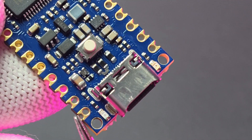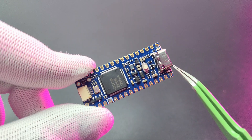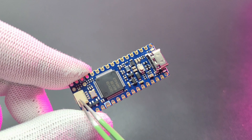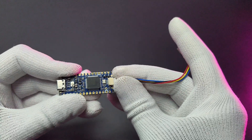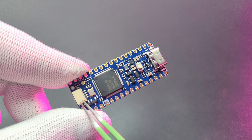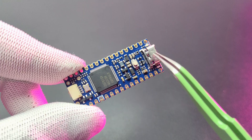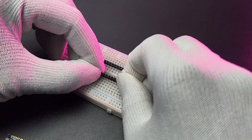It has both THT pin holes and SMD solder holes. The board has a USB Type-C port for programming, and it has a QWIIC connector where we can connect 3.3V I2C sensors and Arduino modules. It also has a 5V-compatible I2C port on pins A4 and A5, just like the Nano R3.